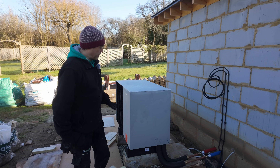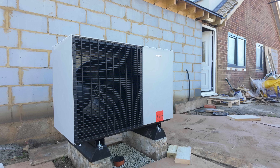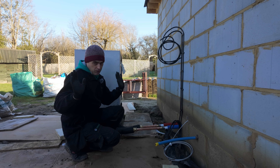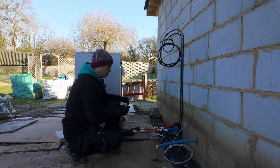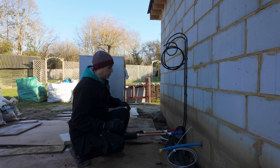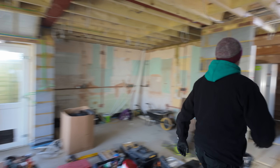We're back at Guild on a very cold morning doing a second fix, and finally this building site will have some heating that it really needs. If you look at this and think 'why have you put the unit a metre away from the wall?' — we got asked to do that. The reason is there'll be a path above the pipework and wiring so everything will be nicely hidden away, and it allows the owners to walk behind the unit to their back garden.